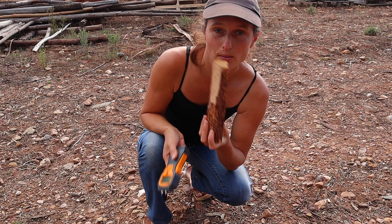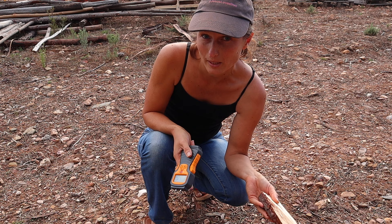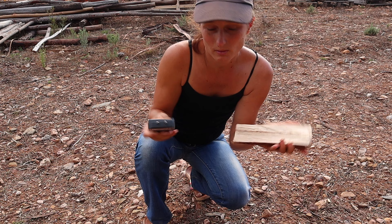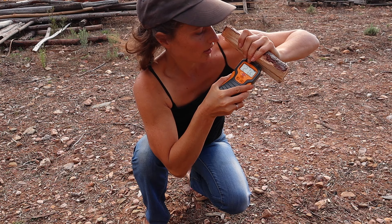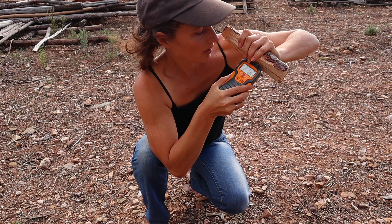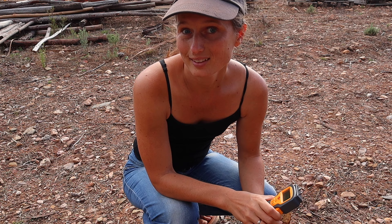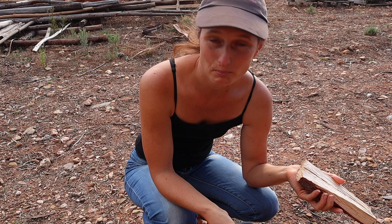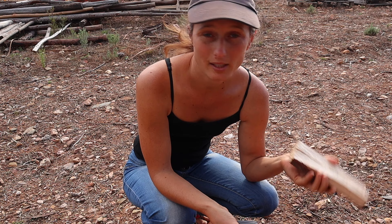So I can use it. This pine has been lying as a full tree on the top of our land, cut somewhere in March — not in pieces, as a whole tree. And I can feel it — it's still wet. It goes up to 21, so that needs more time to dry. You definitely need to cut it in smaller pieces to make sure. Even if I cut it early in the season in spring and had it in the sun the entire summer, I can use the wood when cut in pieces, but as a full tree it's not possible yet. This will dry pretty fast with dry weather coming, and we might use it for a campfire but not in our yurt.